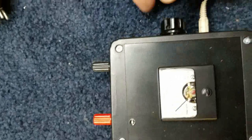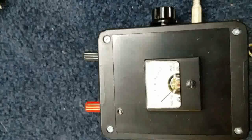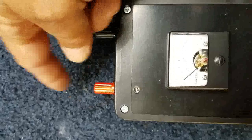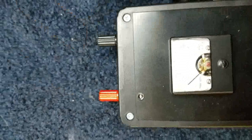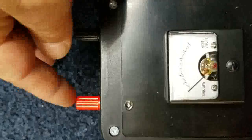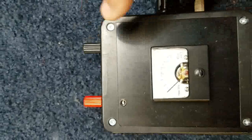This is my final version of my high voltage tester. This is the voltage control knob. A regular 12-volt DC wall wart plugs into the jack. This has a hot terminal right here — that's dangerous, that's why it's red — and this is the ground terminal. The ground is positive and the hot terminal is negative, but I made this red so people wouldn't get confused and think that this was the ground and this was the hot, because it isn't.